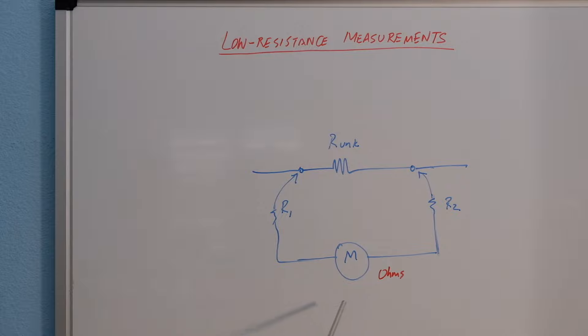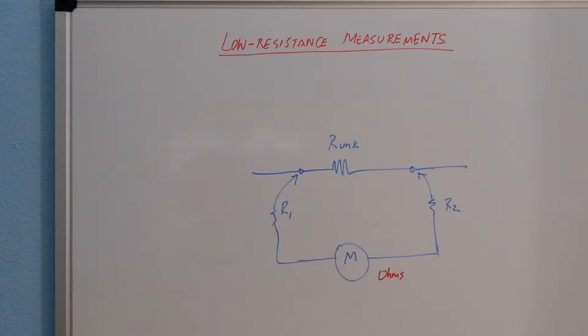I am not going to be able to measure large shunt resistances which typically tend to be less than 1 milliohm - for that you would need a micro-ohm meter. I do feel that the lock-in amplifier might be able to get there, but there are other problems with measuring sub-milliohm values with respect to metal interfaces and contact effects. Anyway, the first technique is a 2-wire measurement and next is to go to a 4-wire measurement.